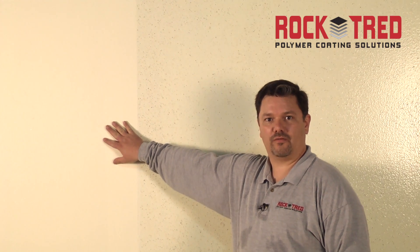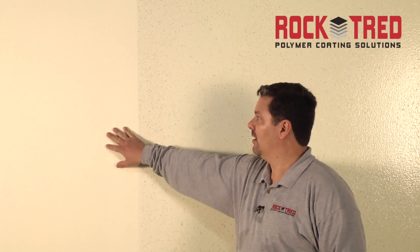Now we're taking you to the RockTread Museum to show you a couple of optional finishes for the ChemWall system. We showed you the mat layup system and demonstrated how it was installed. These systems can include the mat or can be installed without the fiberglass veil laminated between. The fiberglass veil adds reinforcing strength and, depending on your job, it can add thermal shock resistance and much more durability. But for lighter duty systems that just require cleanability, antimicrobial, fully sealed finishes, you don't necessarily need to put the mat in — you could finish with the ChemWall Sealer and just leave it.